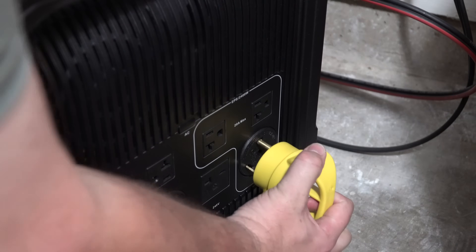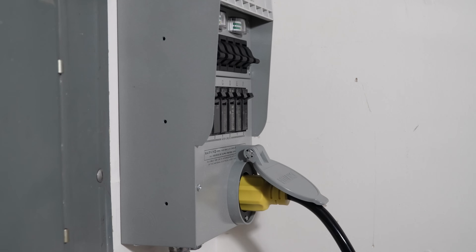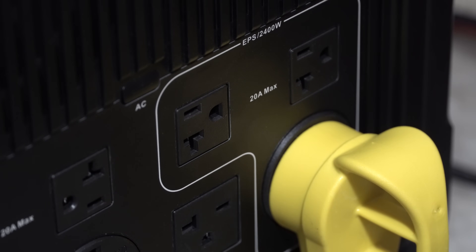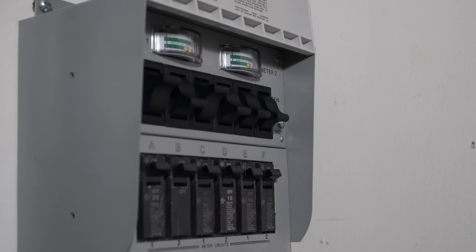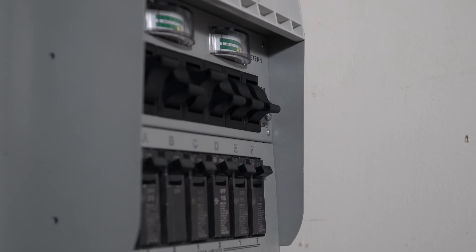That's 240 volts into my switch, but what about 120 volts? The 6000 has a 30-amp, 120-volt RV plug — it's a TT30. It's capable of delivering 3,600 watts from the 6000's inverter through my transfer switch with an adapter cable. This allows me to put 30 amps of 120 volts into my system. Like almost all 240-volt systems of this size, if you're charging at 120 or 240 volts, you're not able to output at 240 volts. That means in order to take advantage of the 20-millisecond EPS function at 2,400 watts, you would need to output at 120 volts, and the RV plug is capable and covered under the EPS protection. I only have two circuits on right now, because we can't do almost 6,000 watts on 220 volts — it's really limited to 2,400 watts with the EPS.